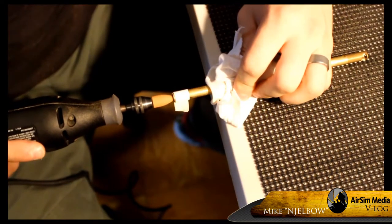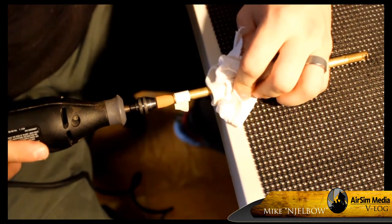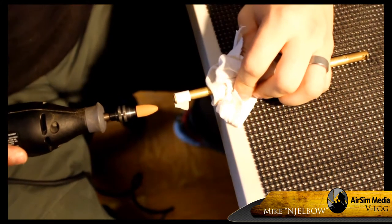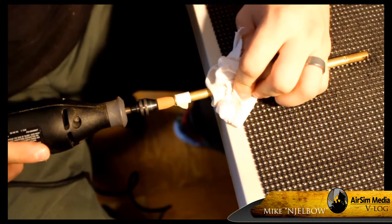I was trying to give the edge of the barrel a nice concave end, thinking about how some of my Prometheus barrels in the past look. Crowning, as it's called, avoids the buildup of negative pressure on the BB as it travels down the barrel.